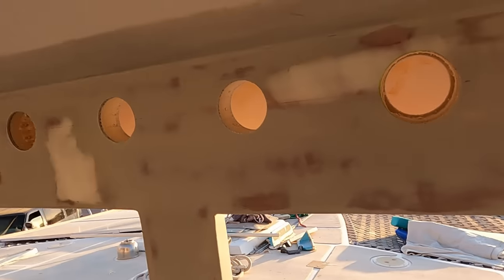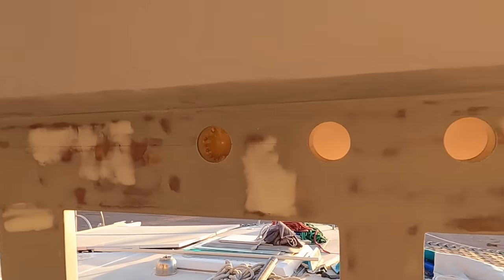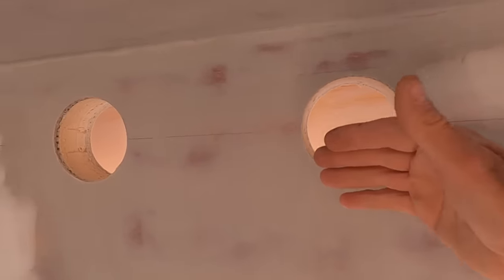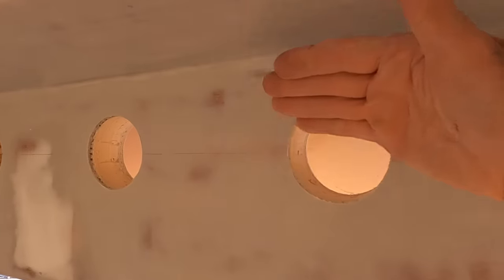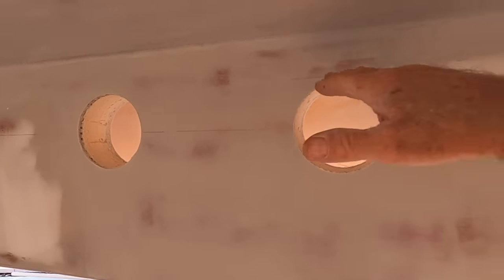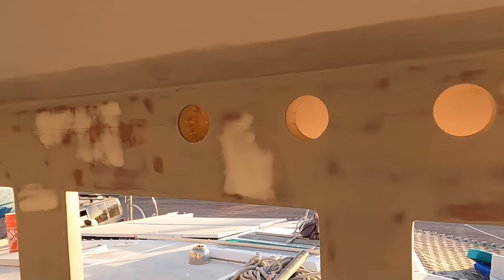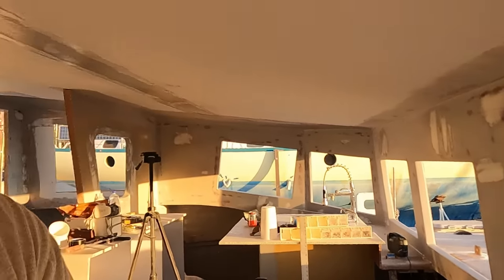I also came up with another cool idea. I wanted some really nice indirect lighting that would have a really good effect on this room. I was going to do this anyway, so this kind of came with the idea. I plan to build a small angled ledge, very, very thin, maybe a 1/4 inch or so. I have some composite that might work for this. I'm going to angle it upward so it will have the air coming in, but you will not see the hole itself. Behind that I'm going to put LED strip lighting, so it'll angle and reflect off the area, and it should have a really nice effect. I can do any color I wish because I bought the 5050 RGB. It has that multicolor remote, which, as you know if you've seen it, has unlimited color potential, so you can pretty much do any color.